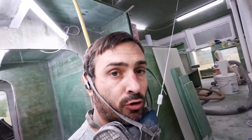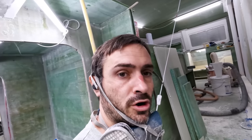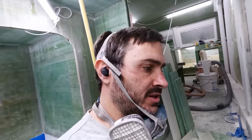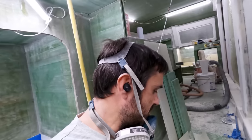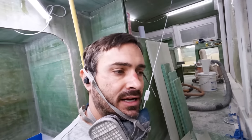These are both 2¼-inch holes, or all four of those are 2¼-inch holes. And that will be for water running aft. We're gonna have the engine back here, and we'll actually have a water heater back here. So we do need the ability to run water one direction and another. And then like the AC lines most likely will be running through there as well, through the other tube. But just wanted to kind of show you how those conduits are getting ran, and it's all going to make more sense when we do that hybrid system install.